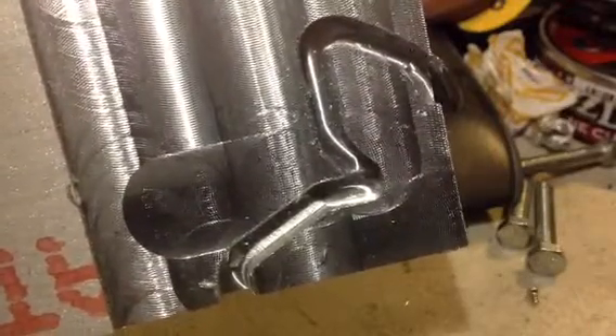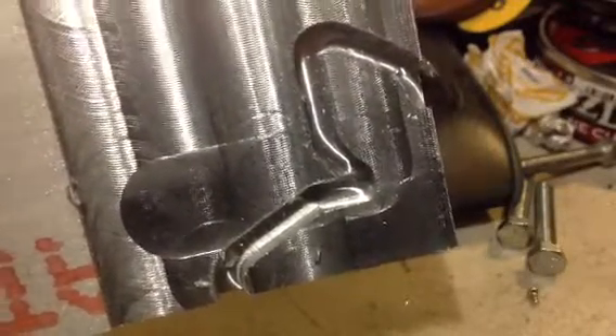Hey, here's what it looks like. I just used the old one for now, just so I can do some practicing and stuff. I thought I had quarter-inch aluminum but I don't. What I had to do was a facing operation — right here I just had to flatten out the top to get it to 0.250.